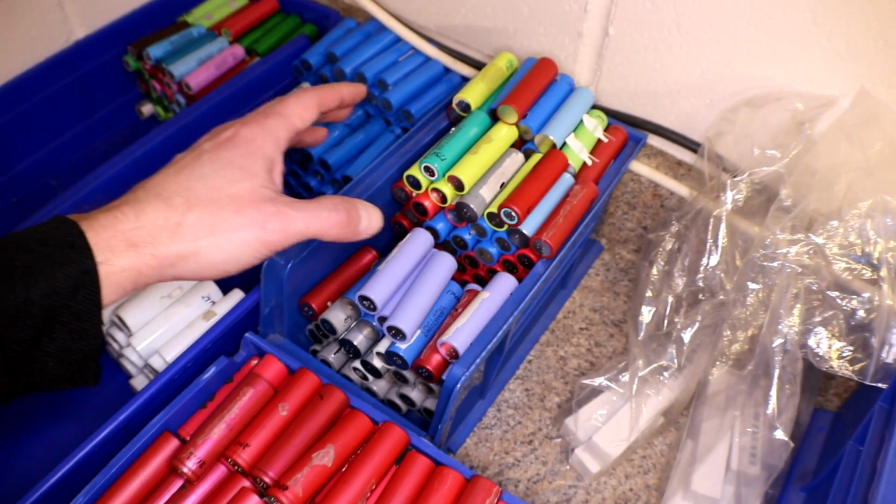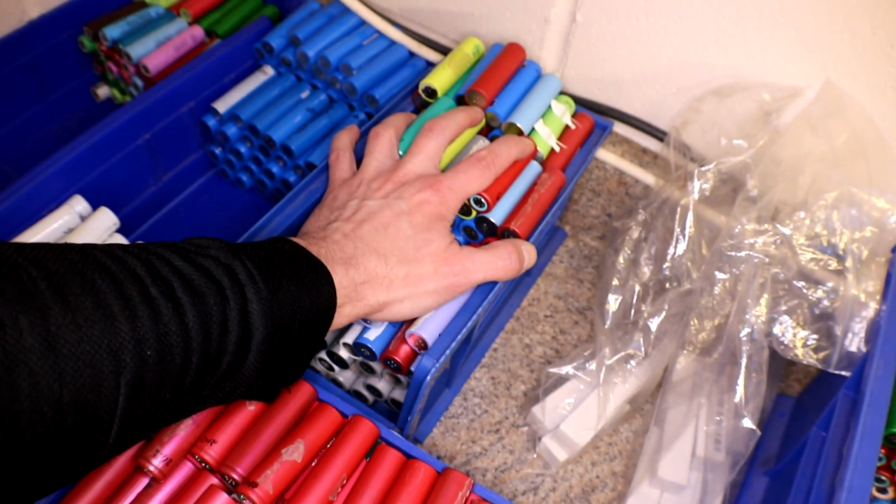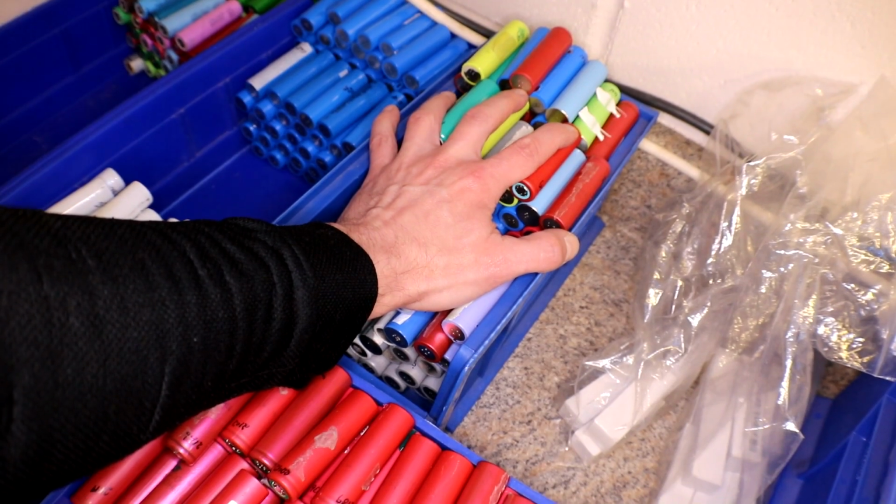and I don't know how this is going to work quite yet because I originally intended on using 15 to 1900 milliamp hours. All right, so the problem I'm having is I don't have 300 or 400 cells that are 15 to 1900 milliamp hours to just throw outside. Most of the cells that I've tested are all above 2000 milliamp hours, and actually a good portion of them are probably like 23 and 2400. Which sucks because I could be using these in my power rack.